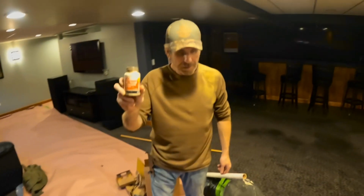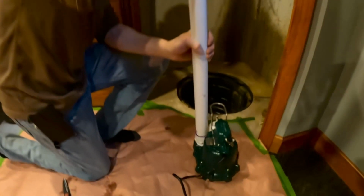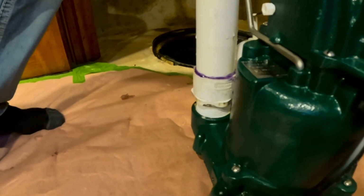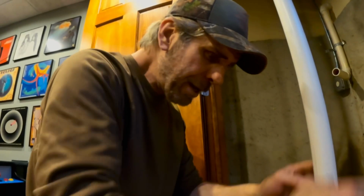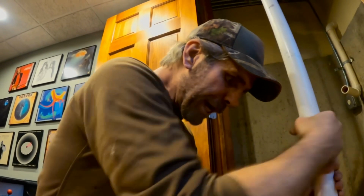And it's gonna go in there. Pipe thread compound. There's no bad way to do it. Just kind of slop it in there with the brush. You don't need to do the other side, because it's going to get on it anyway. You just kind of feel for it. Get it as level as you can. And once it catches, you'll know. Like right now, it caught. See how much easier it goes in with the thread compound on it? Otherwise you would hear squeak, squeak, squeak. And you may hear that at the end, but I doubt it.